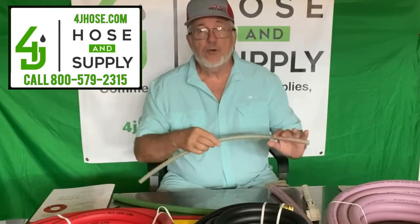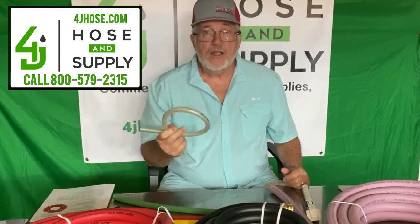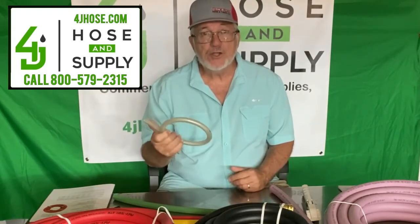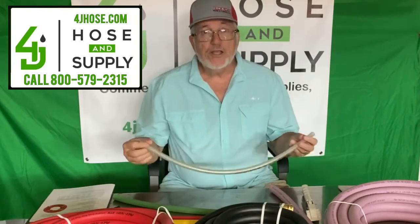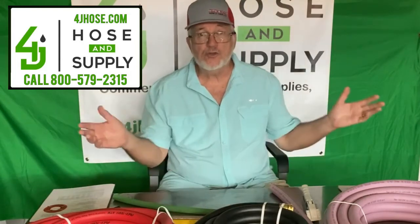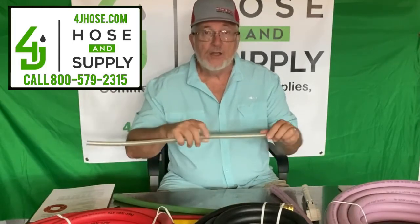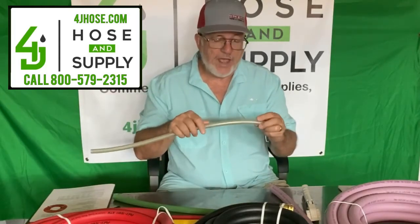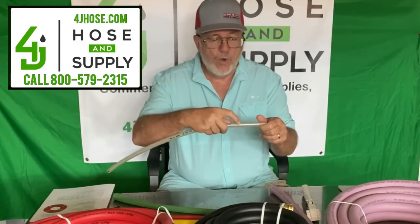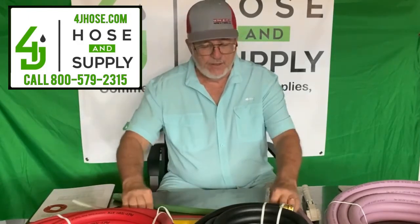Another product is the clear braided hose. This is very popular in pest control today. It's a lower PSI, lower cost, lighter weight — 300 PSI. We carry this in rolls of three-eighths and a half inch, and we also sell it by the foot in three-quarter inch and one-inch sizes. You can use it for suction line or shorter applications. This is a piece of three-eighths that you see. It's very good quality — you'll see how well manufactured it is by the proper spacing of the thread within the hose itself.